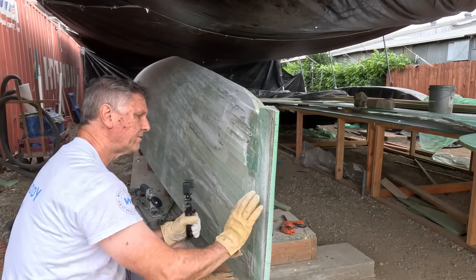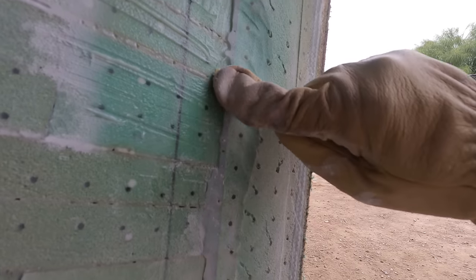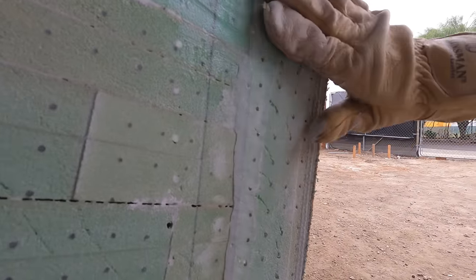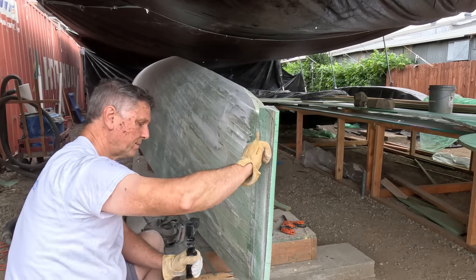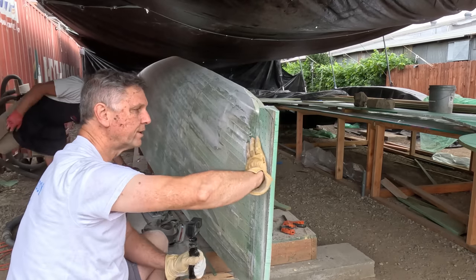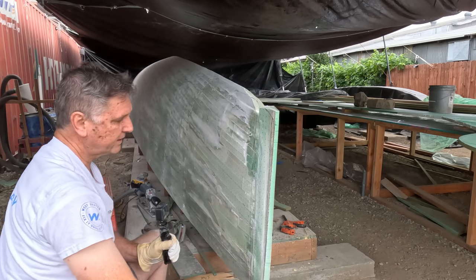For those of you worried about that fast sander taking off too much, I only went in so I can see I still left high along there. You can see that ridge along there. I didn't worry about this because this is just foam. It'll thin down pretty easily, but this hard epoxy here, we didn't want it sticking out a quarter inch. That'd take forever to sand off. So I just left a little bit for the other sander to take off, took up the majority of it so that we wouldn't mess this up at all. Now we can flatten this all out with the flexi sander.